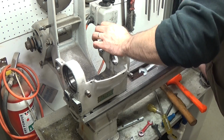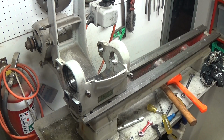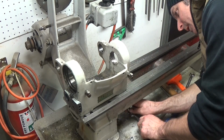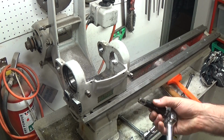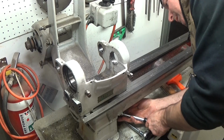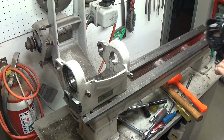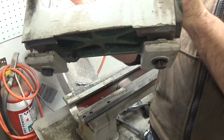That's fun, there's not a lot of space in there. And right, so I have to get to that one. I think I'll try with a socket from underneath. 15mm. 15, and then a 6-inch extension. And of course, 6 inches is too bloody long. Let's try a small one on a 1/2-inch drive. Loosen it off, and this, let's just zoom back a bit, that's it, let's just slide in there, we go. Okay, and that was the 2 clamps on the bottom.